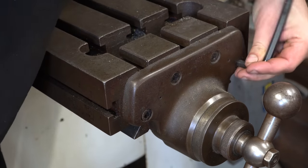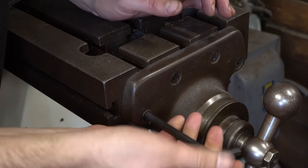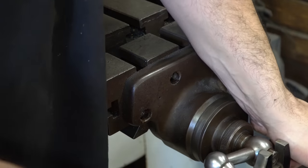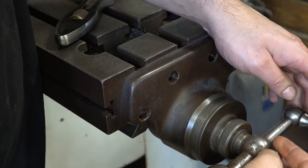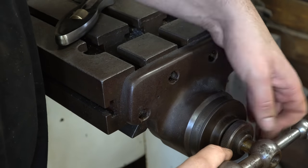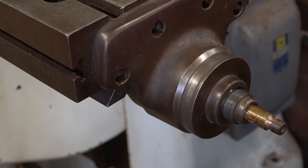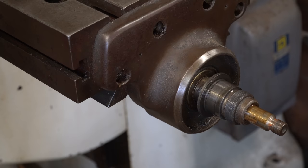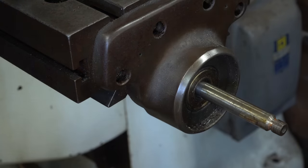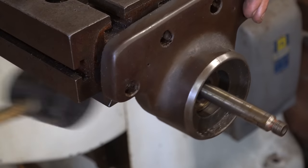The end caps were very difficult to get off — I had to get some extra leverage. These probably were never taken off. I believe it's time to at least investigate and clean up what's going on behind the major components of this mill. The handle could come off in one large chunk including the numbered dial, or you could take it off one by one. Sometimes it's very difficult to get this piece off, but luckily mine slid right off — I didn't need a gear puller. Always keep track of your little keys there — easily lost.